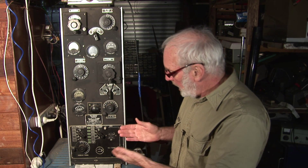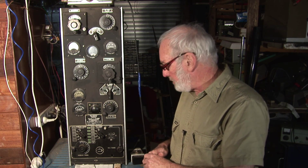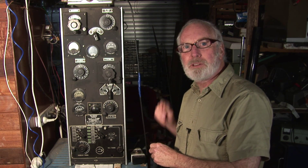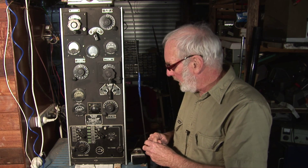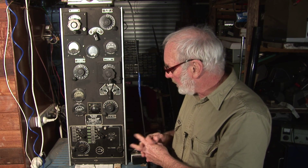This is the oldest piece of equipment I have here that's in constant use. It's an HF transmitter, tunable from 3 megs to 18 megs. It will do 160 with some capacitor stuck over various coils inside there. Very nice set, very versatile and quite old.